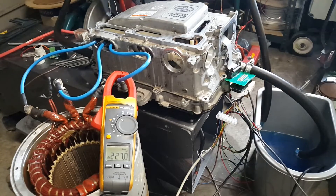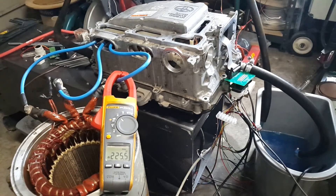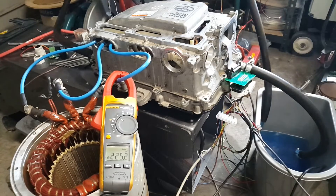It's either the cable that's going to let go first. I should also probably tell you at this point that I don't have a fuse anywhere in this circuit, and my emergency disconnect is basically a wire cutters. Probably not the cleverest. Those feeder cables are definitely warming up. I'm going to dedicate this video to the people that say the Prius and Yaris inverters would very quickly overheat at 100 amps, couldn't maintain the temperature, couldn't maintain the current, and just wouldn't work very well. So this is for you guys.